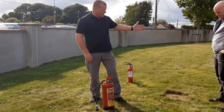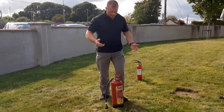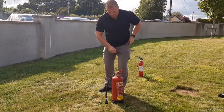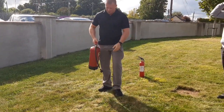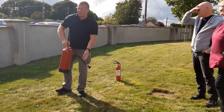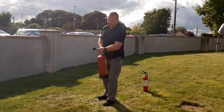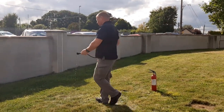Same thing again — just put up the handle like this. Generally people won't look at the gauge if they're in a rush to use an extinguisher. You should always test it before you use it — just test it outside or in a different room, just give it a squirt. And again for something really small, catch the end of the hose — if you catch it back here it can go anywhere. So I'll just approach again.